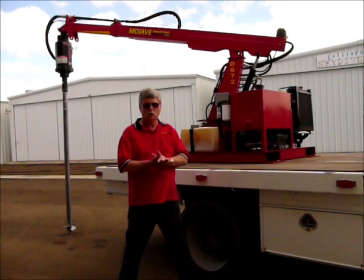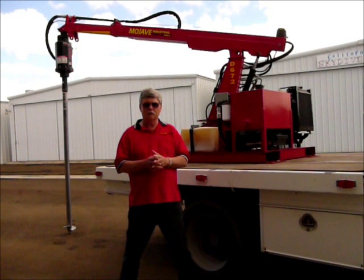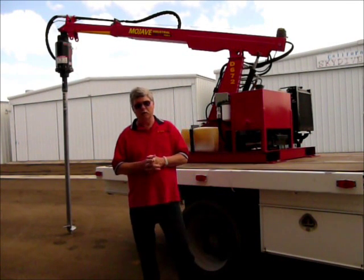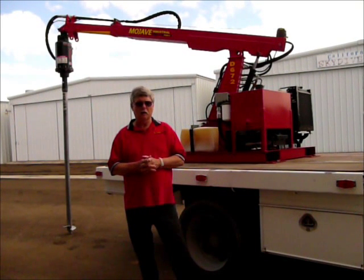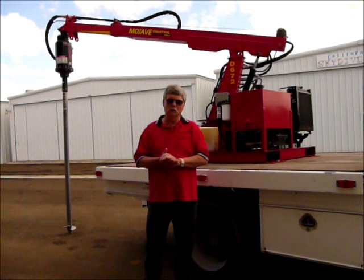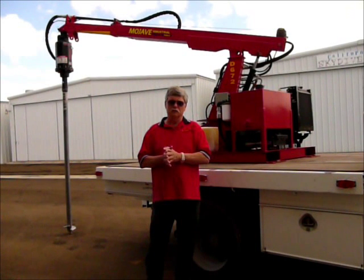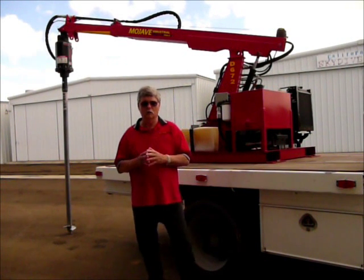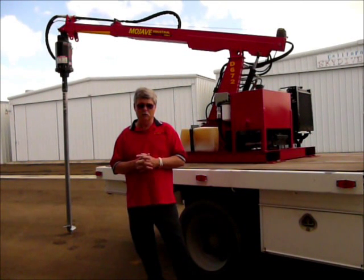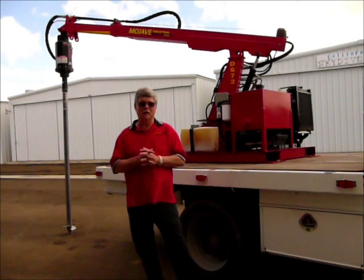This unit, called the Road Worker, comes in 22, 35, and 50 horsepower. The tool we're going to use to drive the helical earth anchors today produces 3,000 to 3,500 foot-pounds of torque. We can also go to the Utility Worker, which is much bigger and can produce up to 5,000 foot-pounds. Right now we have units in Indonesia and Malaysia, as well as throughout California. In Indonesia and Malaysia they're used for helical earth anchors in the oil industry, for above-ground piping tie-downs for typhoons, and for guy wires for gas and oil rigs.